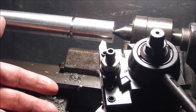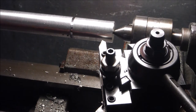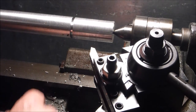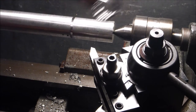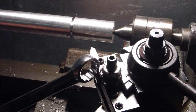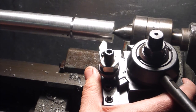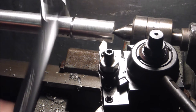You switch over to using a quick change tool post, and suddenly, if you want to get up into a shoulder like that, and you try to turn this bad boy to get that clearance that'll reach right up in there, suddenly I'm in danger of hitting back here as soon as I engage my work over here. So I've seen different grinds, and I think I understand now why I've seen them. If you're putting high-speed steel into a quick change, you pretty much want to be able to always keep that bad boy square, in parallel with your work, or square to your work.